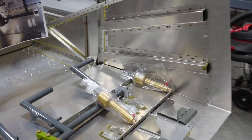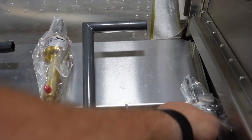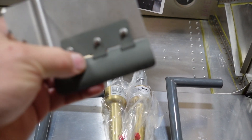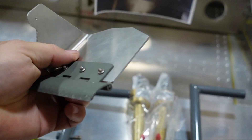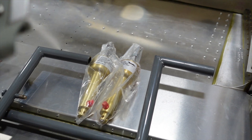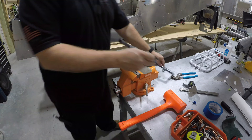Another area I've been working on — or waiting on, I should say — is this front brake area. Everything's just kind of loosely fit right now, but I finally got the Matco brake cylinders in and those showed up in the finishing kit. That's going to allow me to really line up the brake pedals that we had to manufacture. If there's any confusion about how to do this, there is a current updated drawing on these — they look like door hinges here. But you basically have to pound these into shape or put them in a vise and bend them to get that shape, because that actually rivets to the back side of your rudder pedal, and that's what actuates the brakes.